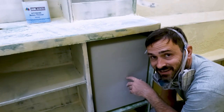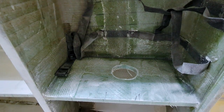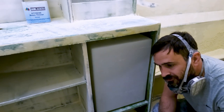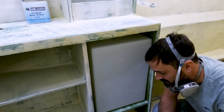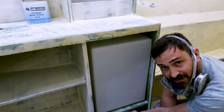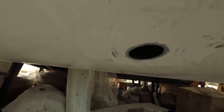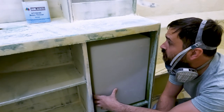The big part is going to be setting it up so, of course, it doesn't move around on us. I've got to cut a hole in here, and then the hoses will come through this, and it'll be correct discharge here. Now, the water line's way down, so we don't have to worry about it. We're 250 millimeters, 9 or 10 inches above the water line, so plenty of space there for discharge. Most likely you're going to put a valve on the bottom here, so there's nothing in the hoses if we don't want it. And then we'll have our cool little Forespar seacocks down at the bottom here, and we can just discharge it as needed. But that's going to be the next project.